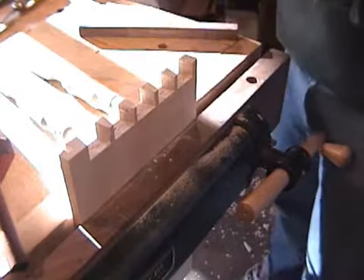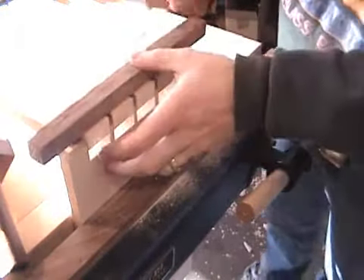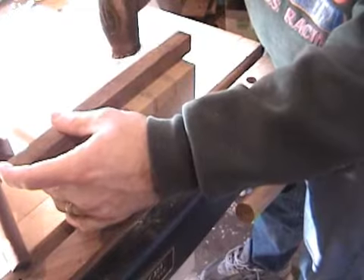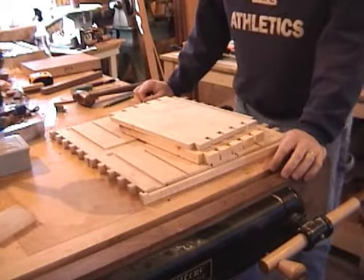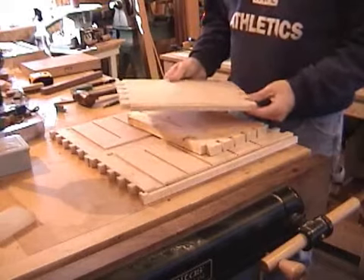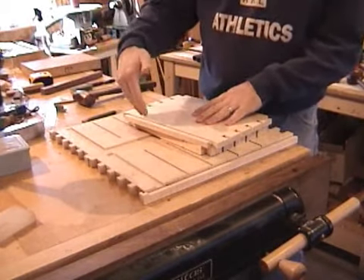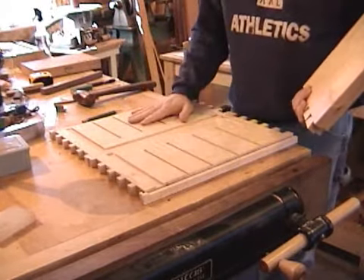Okay, so now it's the moment of truth. Let's make sure that the bottom fits in here the way it's supposed to. Very good. So at this point all of our dovetailing is done. Same process for making the top as it was for the bottom. One detail though that I didn't mention is that after you get the top dovetailed, you're going to go ahead and plow out a dado on the back edge, and that's going to line up with the dado on our sides, and that back will slip into that. At this point we've got our top, bottom, and two sides completed, and it's time for glue up.